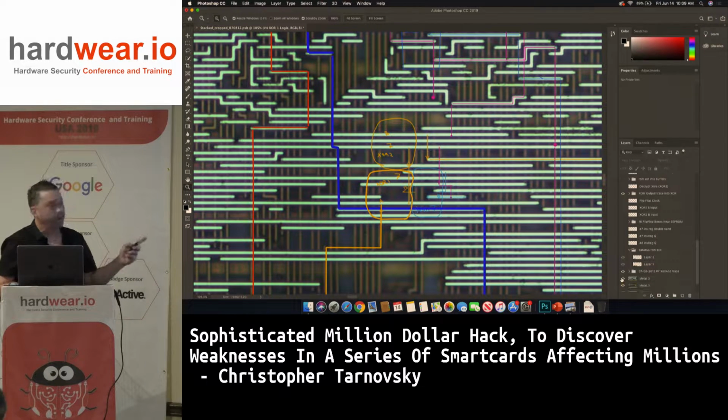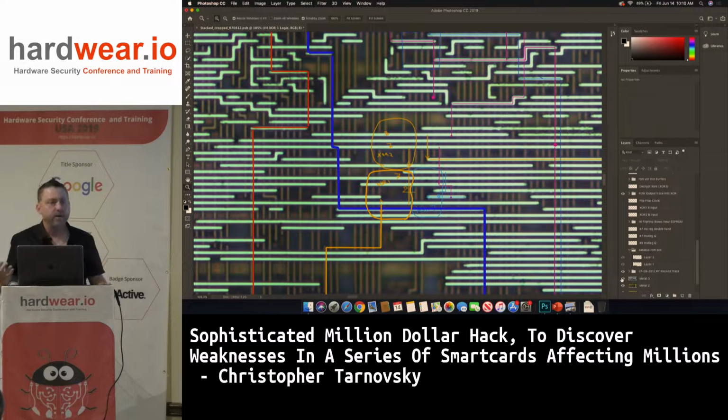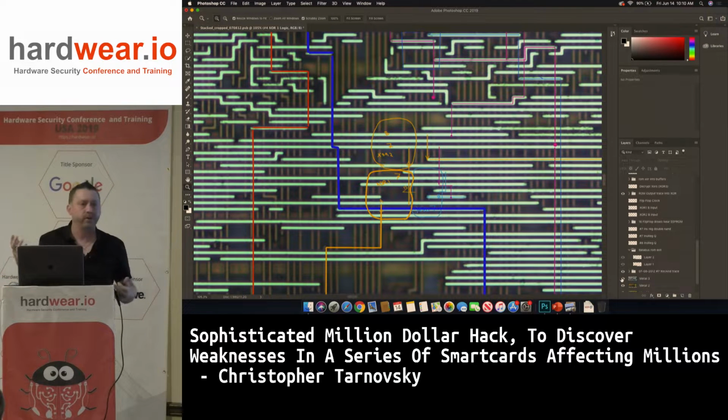So, the reason was probably I was going to load this chip into the FIB later and then do what I would call my mask set. So, you know, these guys that design it know exactly how many microns to move over to go to the instruction register, for example. But in my instance, I have to make this myself. So this chip I would load into the FIB. It's white. It's perfect. It's polished till it's white. So these are bare aluminum wires now. I would move to a bond pad kind of close to the area I'm going to go from. So, for example, the bond pad could be up over here, and I'll move over so far and down so far in microns, in micrometers, in the FIB,